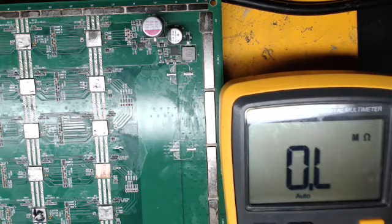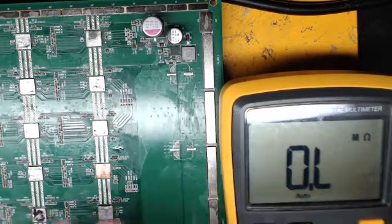So this chip passes my first test on whether it went in right. The second test was obviously running video. It turns out that this guy right here — called CI if you look on the back — is coming in at 1.7 volts and arriving at the chip at 1.3. Frankly, I don't think that's good enough, and it's still saying zero ASIC — might be another problem. Solomon told me to check the power supply, but I am getting power here, and that is the power supply that feeds those guys. I will recheck that again for sure.